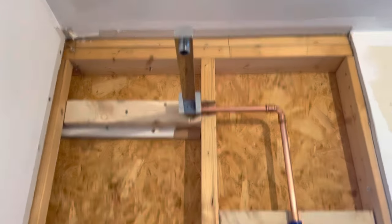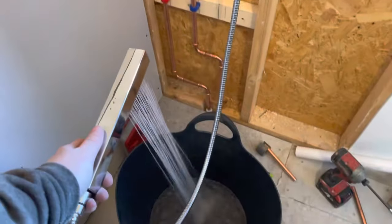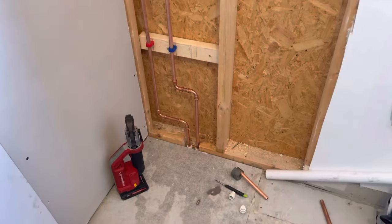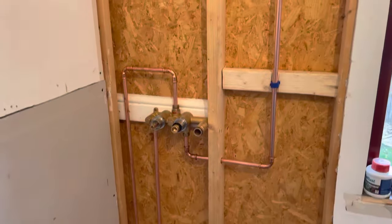If it's hidden, that's hidden — I could have done it in here, pushed it in, whatever, but it's done. You always want to test your fittings, test your water, make sure you have no leaks. Sheet it, forget about it — you'll never have problems. But the thing is, always, always test your work and make sure everything's okay before closing up.